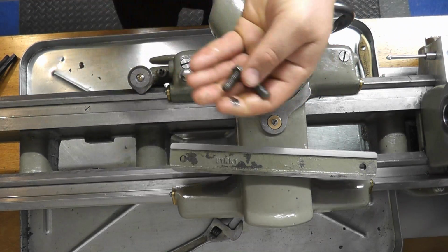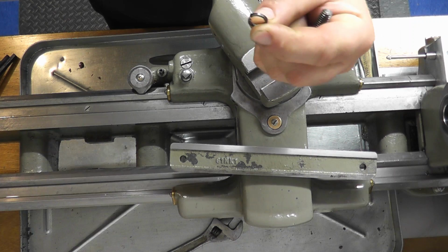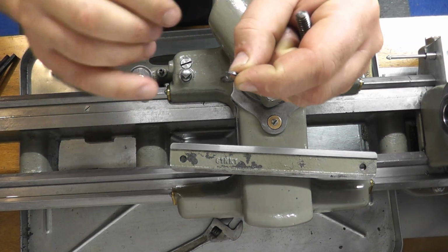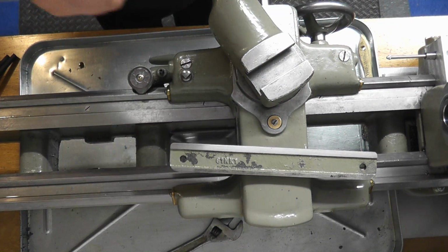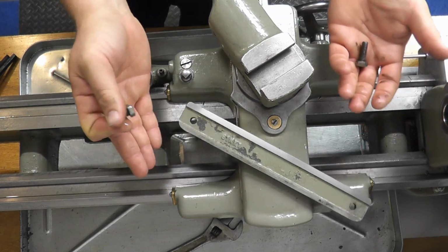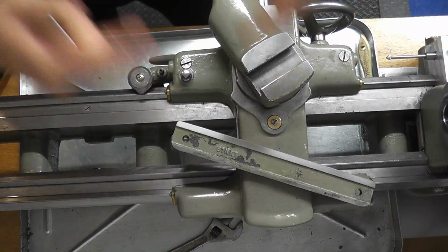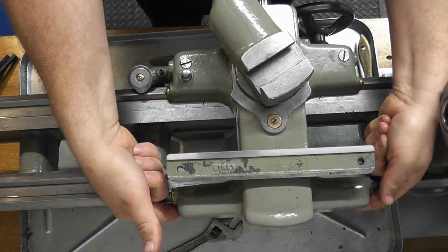Now on these bolts are usually lock washers. These aren't the ones; on mine they were missing. I took these. They should be a little bit heavier than this, but these are some smaller ones that I bent with a wider opening. And that gives you some spring, because you don't want to bottom out these screws to get this tight and basically bind your carriage. Now what this gib does on the bottom is what keeps the back of this whole saddle from lifting up.